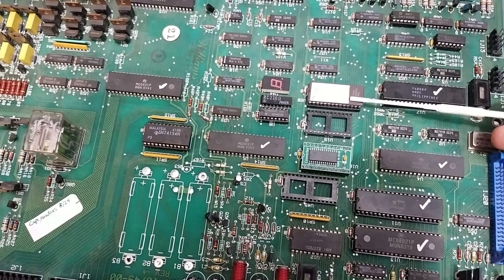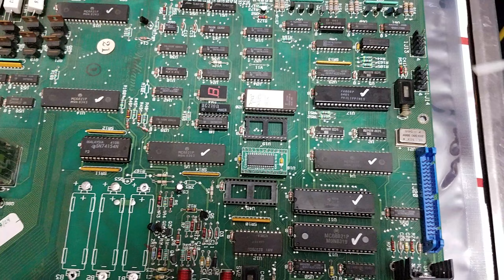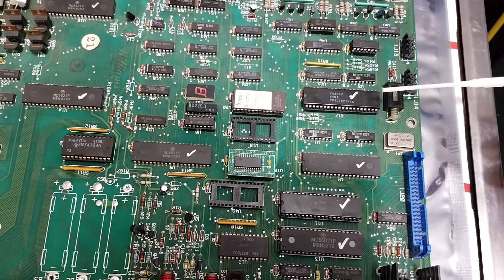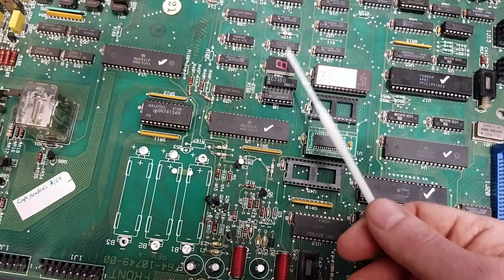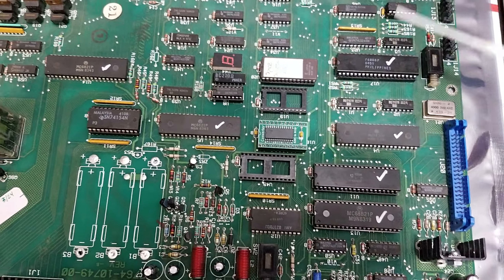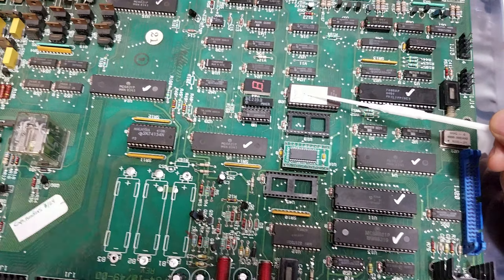I plugged in Leon's test ROM for System 9 and went through all the troubleshooting steps — checking for moving signals on the CPU, making sure I had a good clock from the crystal, a good external clock out of the CPU, good VMA, IRQ, and that data and address lines were moving. With the logic probe, nothing was wrong with the processor — everything was moving. I then focused on what actually makes the diagnostic digit light up: it's a 7447 chip and a resistor array that goes straight across at 270 ohms. Everything was running, but I wasn't getting any display because the 7447 was bad. By replacing it, I actually got a digit to come up.